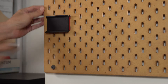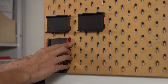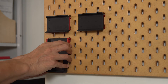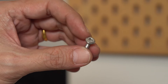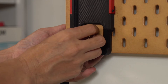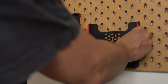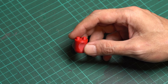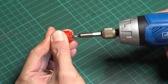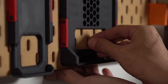For my setup, I'm planning to place all the chargers in one corner of the board for easy access, and I'll mount a power supply on the wall beneath it. However, in the corner there's a screw for the pegboard's backing, so I'll need to relocate it and replace the original screw with a slimmer M4 screw. Additionally, when I installed all the holders, I noticed some sagging at the center of the board. To fix this, I designed and printed additional backers — simply use an M4 tap drill bit to create a thread, then screw it into the slot where you require extra support.